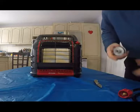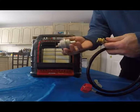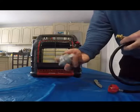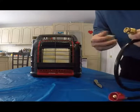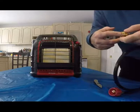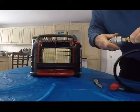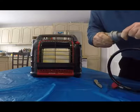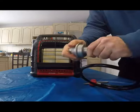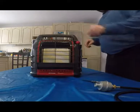If this works out I'll probably end up getting an approved hose, but for now I've got the filter. The male end goes into where the tank would connect to the female on the heater. We have the plastic guard, and the female end goes to the male on the hose itself — just thread it in. There you go — you can see how that connects.